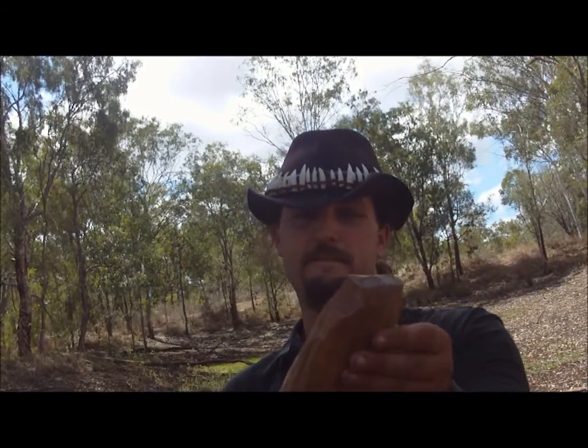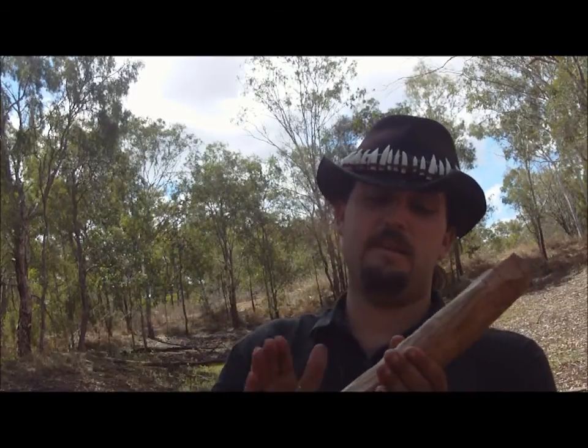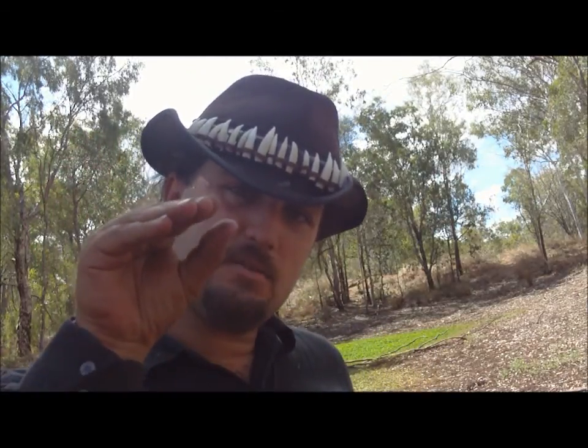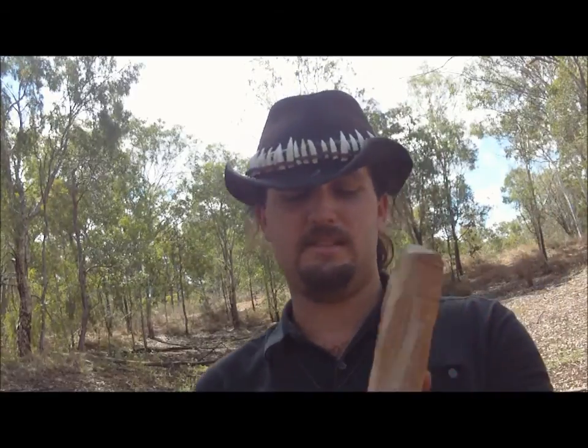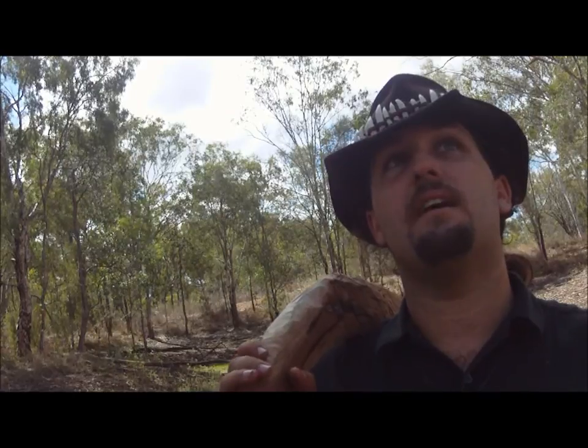The majority of it is quite flat and wide to put as much mass behind the point of impact as possible. I'm going to be thinning out the edges of it like a convex, quite a wide convex, but still bring it down to that one point, so wherever it hits, it'll be hitting on the edge, giving maximum amount of force put into that tiny area, just to maximize its efficiency and make it better for crushing bone and cartilage and doing severe muscle trauma, just really, really nasty blunt force trauma, but really nasty focused blunt force trauma, because after all, this is a hunting weapon.